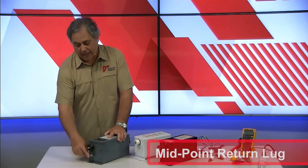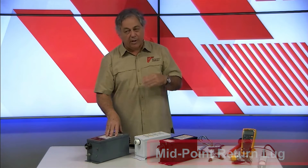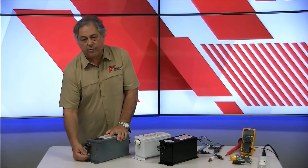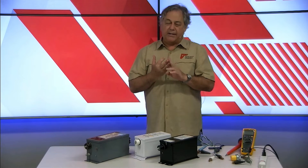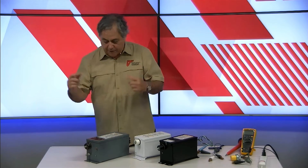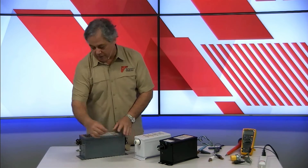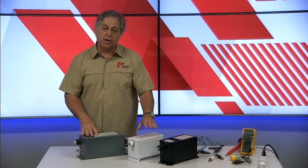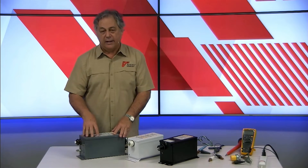On this end of the transformer, besides having the ground fault override button, we also have this lug on ours — and this is a midpoint return lug. Because of how we build our transformers, even with 2161 and even with ground fault transformers, we can have a return lug. The difference is if you're doing service on something that was originally midpoint wired, this lets you bring that end over to the return lug rather than rewiring back to the service ground. If you're working with one of these other transformers, you're looking at rewiring a significant portion of the sign. So this can end up saving you a lot of time in field service work.